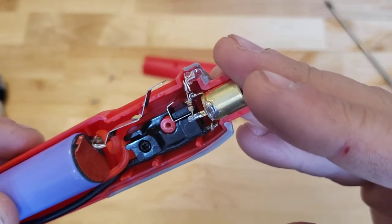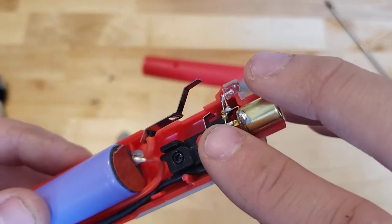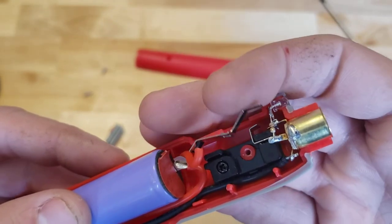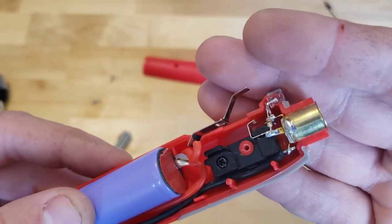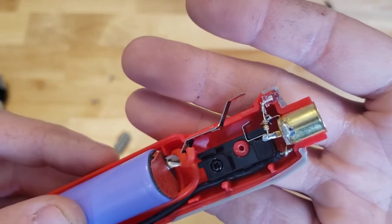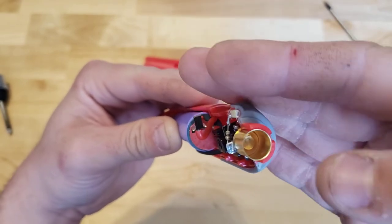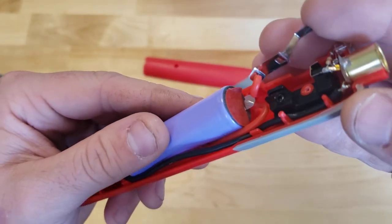As we zoom in here, this is a very simple mechanism. We have what looks to be the positive terminal here — here's our positive post of the battery. So it goes through that piece of metal, which does get hot when you make contact just from the transfer of current, goes to this piece. This piece is attached to the bottom of the cup — you can see that little piece in there — and then the shield around this is the ground, which you can see our black wire going to here.